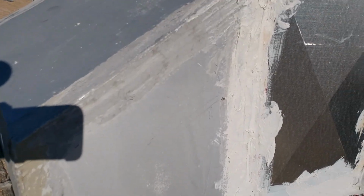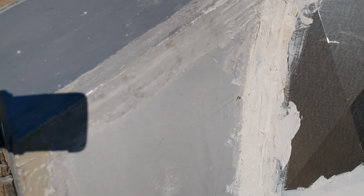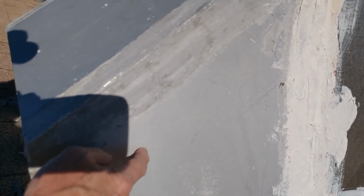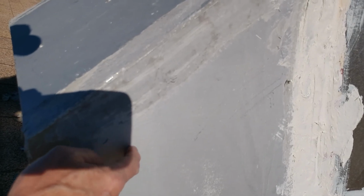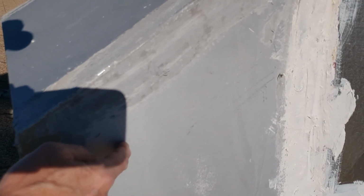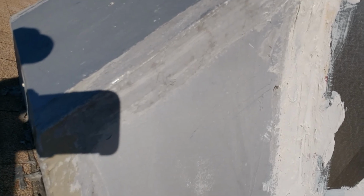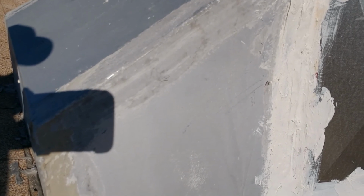Now, when they pulled the old unit off, I noticed there was no insulation on this side, on the opposite side of this, which you have to have insulated. And there was no insulation where the start collar met the bottom of the can down there. So this thing isn't properly insulated either.